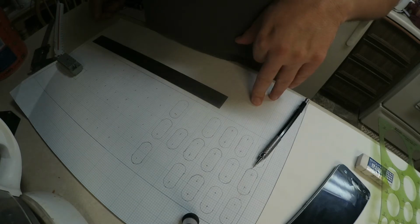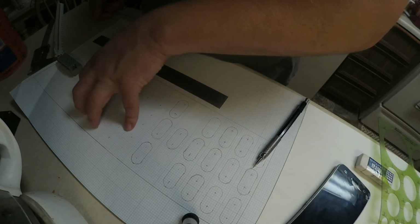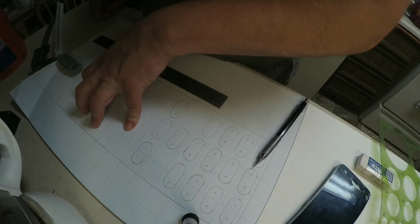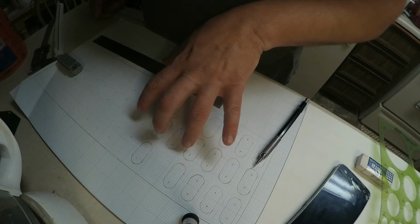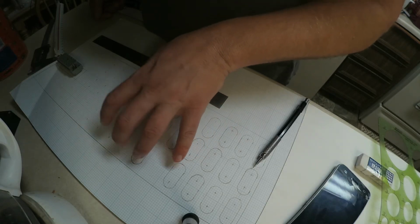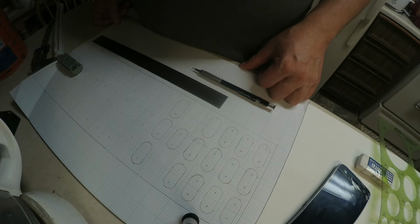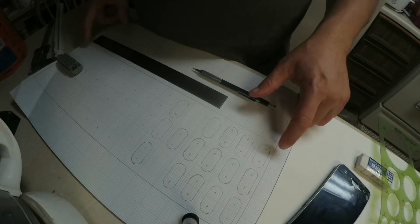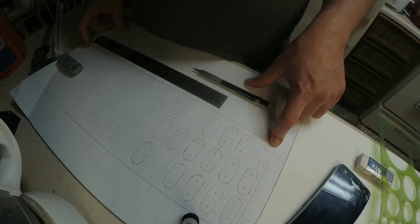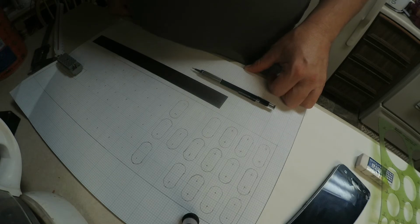I'll just do the rest of this off camera, and then when I get the materials in, I'll start making the final prep to make a permanent template, because I'm actually going to duplicate this multiple times, so it's best to make a template. So that way, everything will be nice and consistent. So I'll have to find a chunk of aluminum about this size, and then I can just whip this all out on the drill press. I can clamp this right to the project box and zip all the holes in there. So that's pretty much it for everybody.